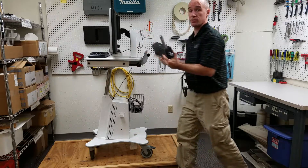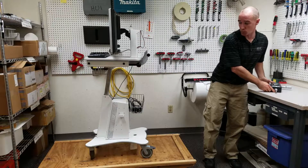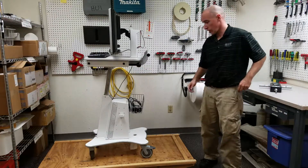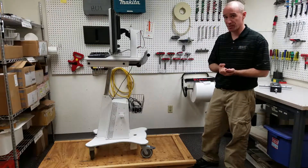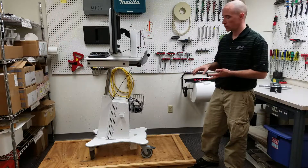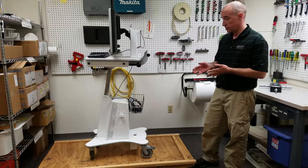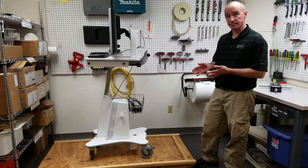By changing the configuration of the wheels, we were able to pass the test. However, this is not a common configuration — most carts in the market go from two locking wheels to four. If you do want a directional lock, generally you would just put one on. And that is how you test your cart for instability of unwanted lateral movement in transport and non-transport mode. Thanks for watching.